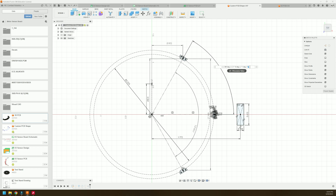For example, if you have a 2-magnet in-runner, that is a single-pole motor; a 4-magnet in-runner is a 2-pole motor. So, the more poles you have on your motor, the more magnets, and the wider variability in placement that you can have on your sensors.